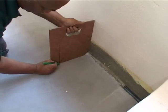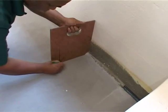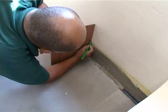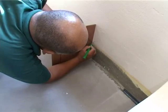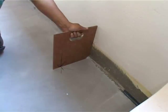The benefit of using a board gauge as demonstrated is that whether you install the cove first or the floor first, you can mark the same dimensions when having to trim either prior to welding, as your floor or wall marks may be covered up after the first segment of the installation.